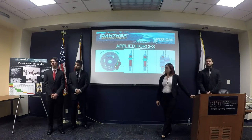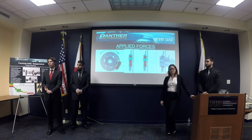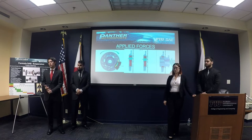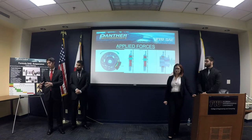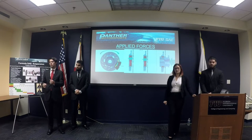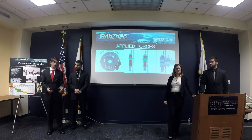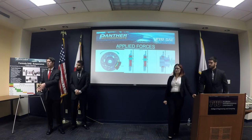Well, in addition to that, those simulations show maximum speed, maximum braking, and maximum acceleration. So the results shown there are like the maximum capacity of the system. Each component was tested with the maximum loads. Therefore, yes, here it shows certain areas of contact or certain areas where it's at risk. But even though it shows high stress, it's not risky enough to say, oh, it's gonna fail. Plus, it does have higher factors of safety compared to previous year. They are a bit high, but that's because, at least in the components for the hub, it's like what we're gonna set it as: if it worked last year, it should work this year.